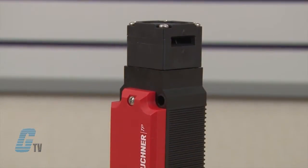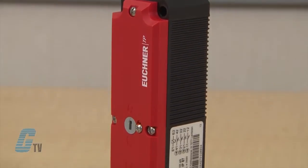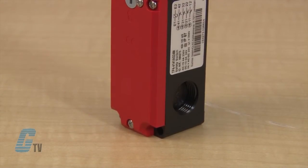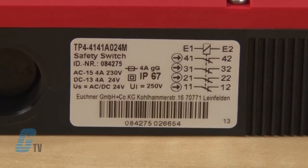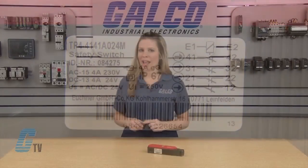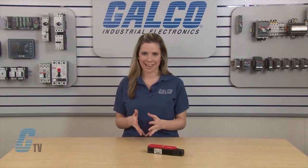The unit is housed in a reinforced thermoplastic casing and has a narrow body, which can be ideal for extruded aluminum guarding. They are oil and dust tight with IP67 protection. There are up to four contacts with a normally closed positively driven safety contact, annunciation contacts, and door and solenoid monitoring contacts. The multiple contacts can be used to help achieve a high level of safety.